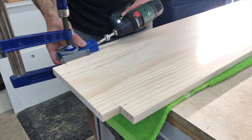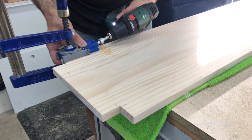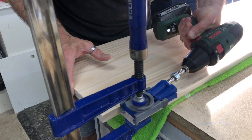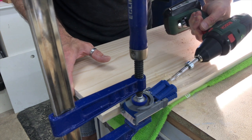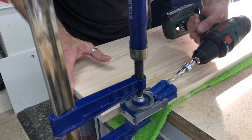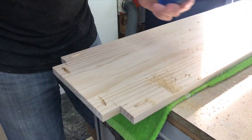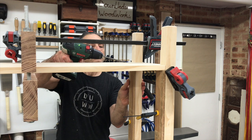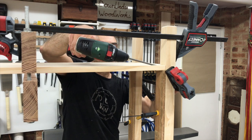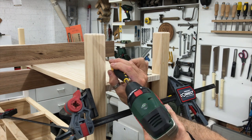The shelf is fixed to the legs using pocket holes on the underside. The shelf adds stability to the base of the legs and also rigidity to the table itself. To make sure the shelf was installed at the same height on each leg, I used four pieces of timber cut to the same length as spacers. These also made sure the shelf wouldn't move when screwing in the pocket screws.